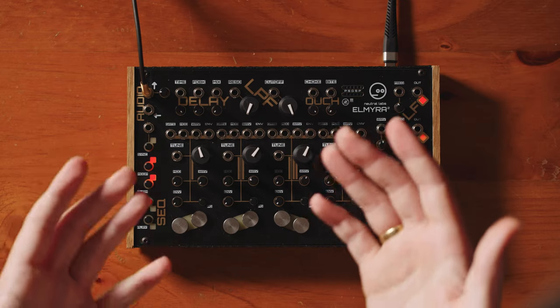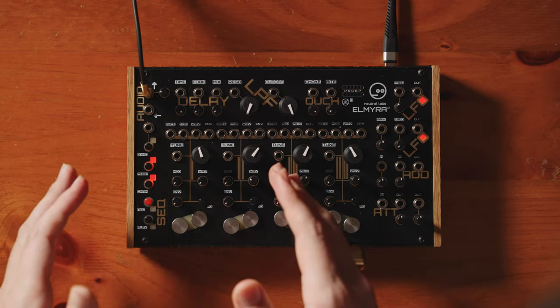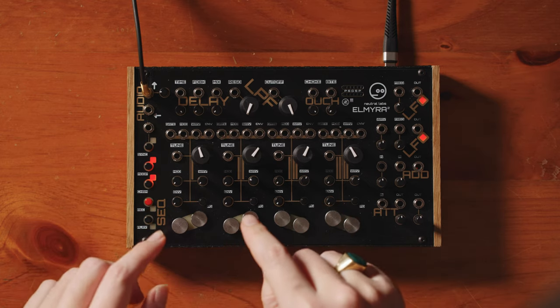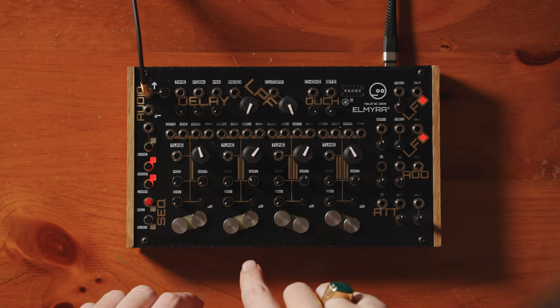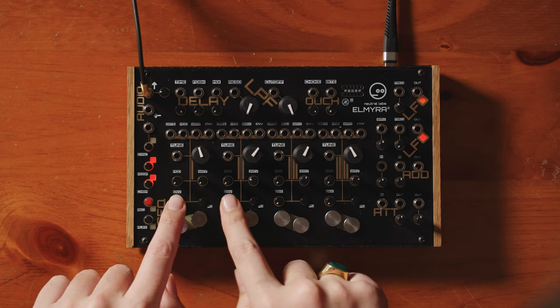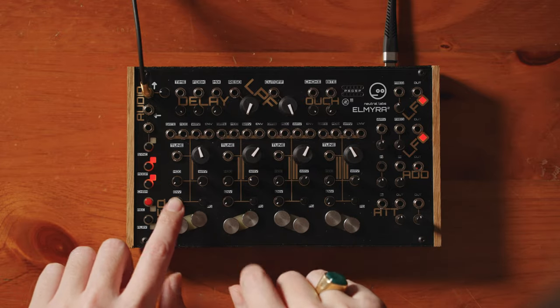Okay, as you expected. And there is also the tune input, a CV input tracking the usual 1 volt per octave. The only individual output is env, sending out the signal generated by the pressure of the metal pads, according to the attack and decay set by the env knob here. They are exactly the same, the four voices, the env knob here.